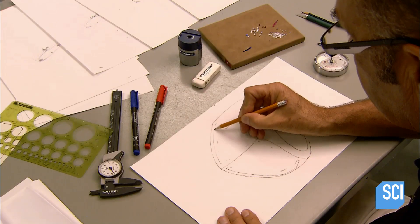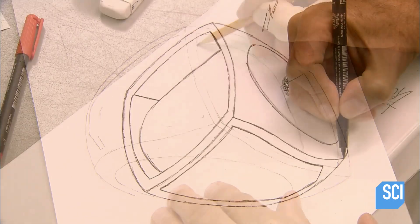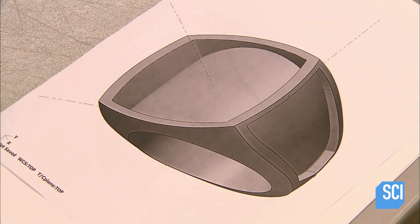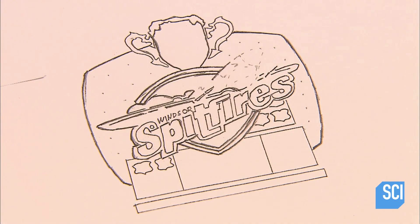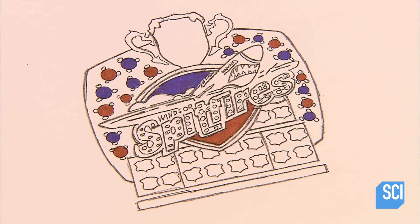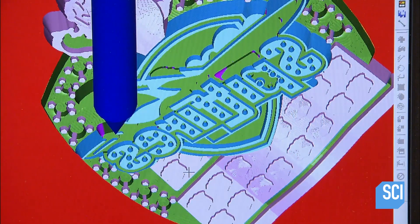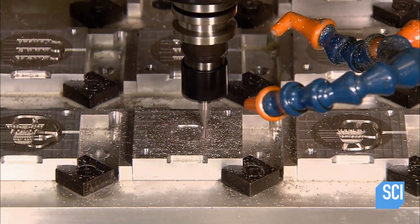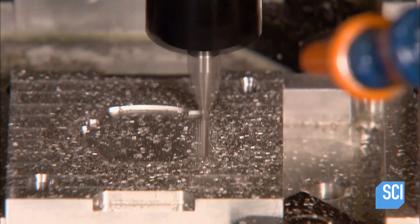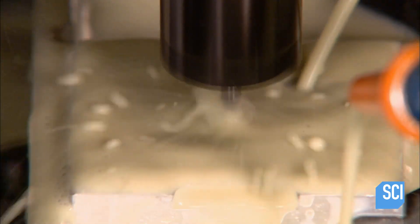Graduates personalize their ring by choosing options such as symbols, gemstones, and engraved lettering. For each style, a jewelry designer first sketches the ring's base — the overall shape of the ring minus the decorative elements. Then an industrial designer transforms the sketch into a three-dimensional computer drawing. The ring's decorative components go through the same process, with the color drawing adapted to 3D software that guides a computer-operated milling machine.